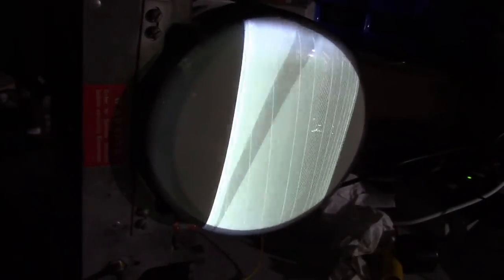Oh, hey, I saw a picture. Boy, I gotta clean these tuner pins. Turn that down so I don't get a copyright violation. Hey, nice. Where's the width? There we go. Oh, jittery. Flaky tuner. Well, I know what I'm doing next. I am going to clean that tuner. Hey, how about that?